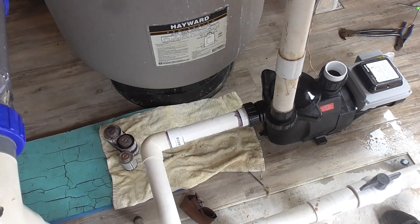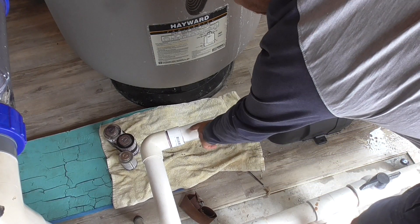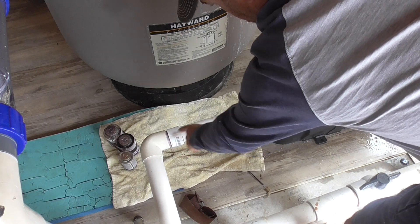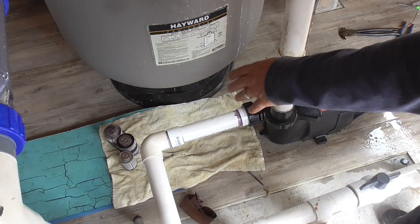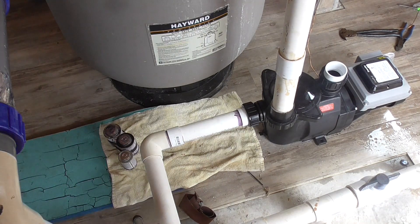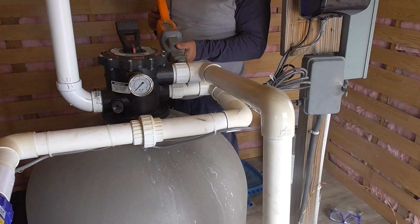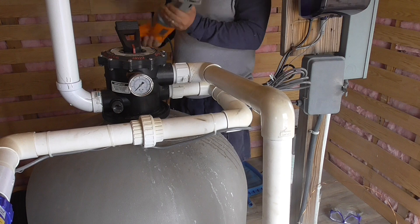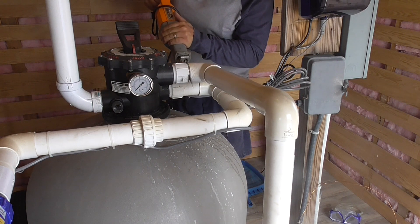This is the inlet side of the pump. The manufacturer calls for twelve and a half inches of straight run using two-inch PVC — that's supposed to make things easier for the pump, which is why this pump sits back a little further than the previous one. I had to cut the pipe here because I couldn't unscrew the fitting with the elbow on it, so I'm using a Sawzall to make quick work of removing the old piping.